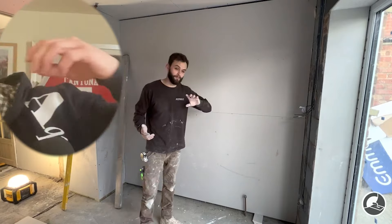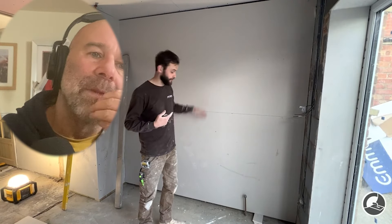He's just put the board on. There's a big gap at the top — at the end he'll be filling that with drywall adhesive, which is a weak point. He said he'd cut three boards but that only looks like two. He could put another couple of packers there. That gap is a weak spot — even with scrim on there it's still a weak point.